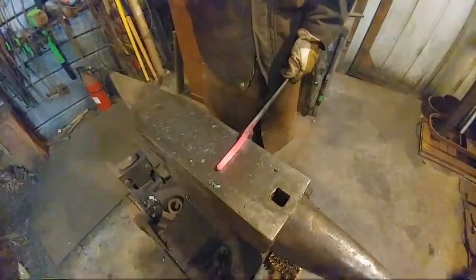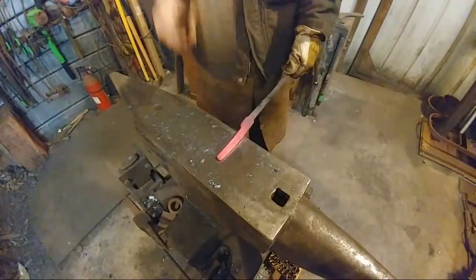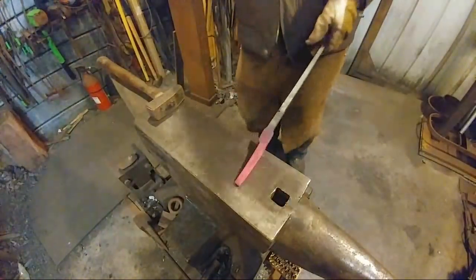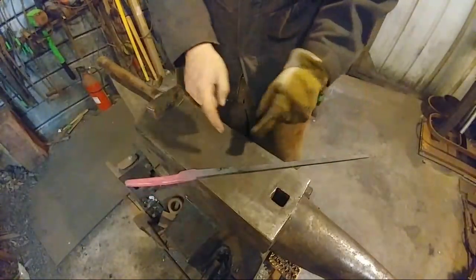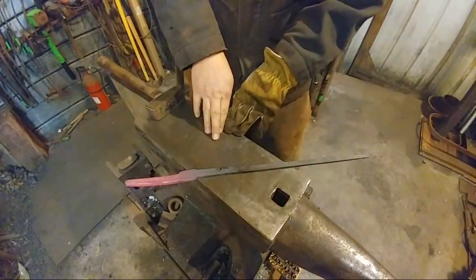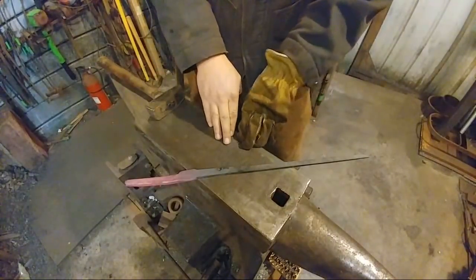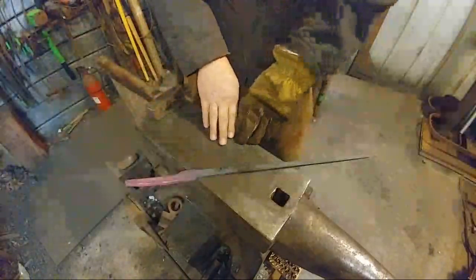To make the spike tongs, I'm looking at an estimated 2-hour time frame or more for lack of skill. Yes, that would be a correct estimate. The reason for that is if you draw out the reins, it takes a while, and it's fairly labor intensive. I plan on doing a video where I do forge welded on reins, but that can get even more complicated. It can be done, it's just a little more labor intensive.